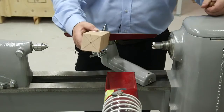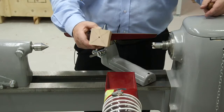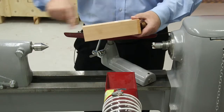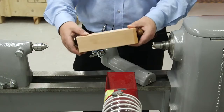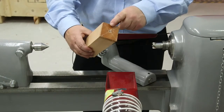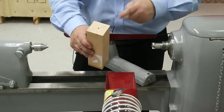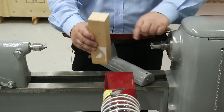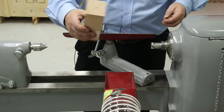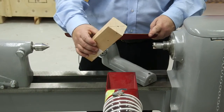Okay, we're going to look at wood turning now on a spindle. That is normally that you're going across the grain, so the grain will be running that way, which makes a difference on the tools that you actually use. You can see that I've already marked up the centres and used a bradawl to make a hole so that they will fix between the fixed and the revolving centres that we've got here. We'll just set this up now and come back in a minute when we're ready to start.